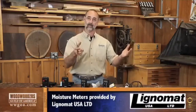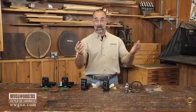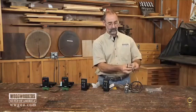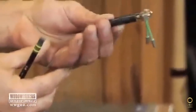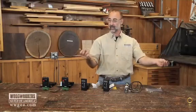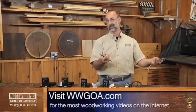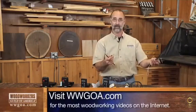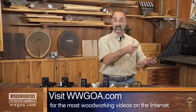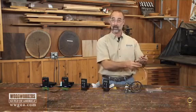If you've got a pile of lumber in a kiln and want to make sure boards in the middle are drying at the proper rate and know when they're dry, you can look at setups like this. These probes get placed into the material with the wires trailing out. When you come to the kiln you plug those wires into your moisture meter, get the reading, then leave with the meter — you don't want it inside the kiln environment permanently. Using these in a couple of different spots in the pile gives you accurate readings throughout your kiln.